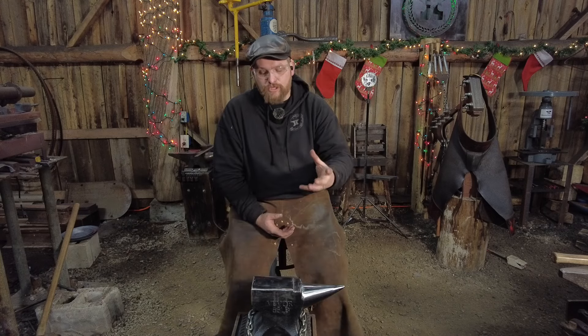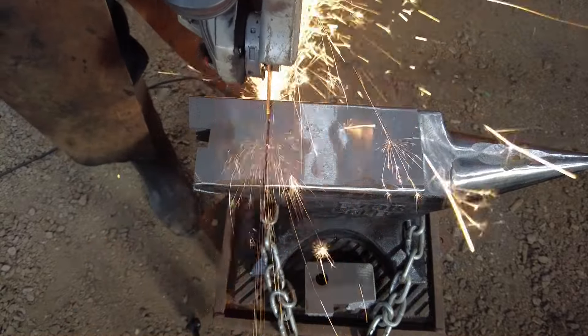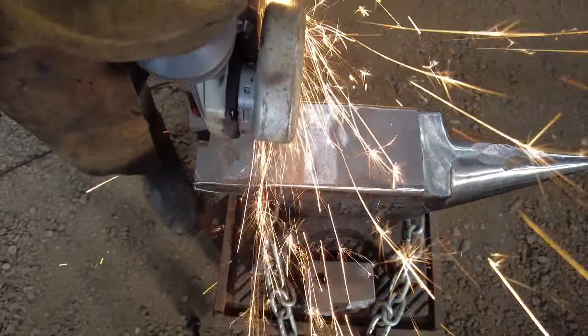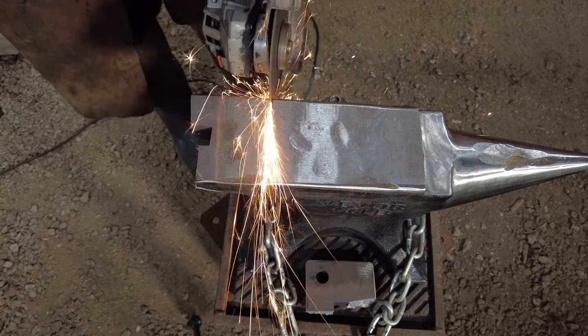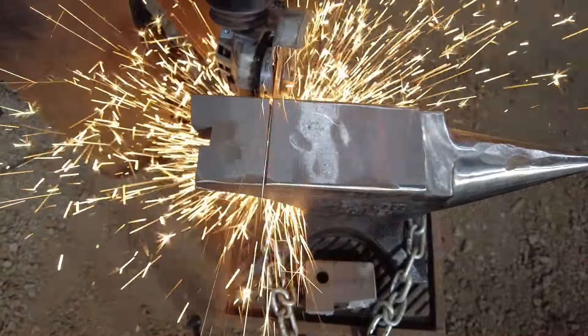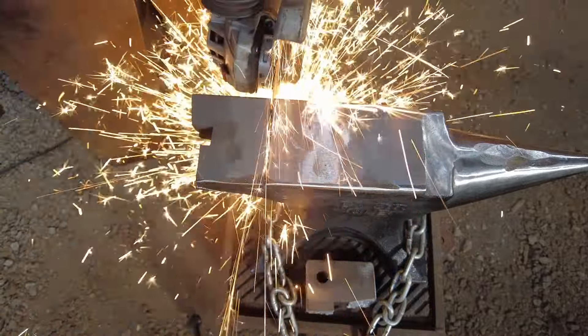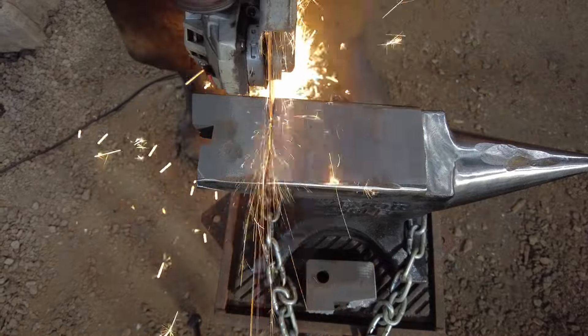After assessing the damage — in this particular case the tail section broke off, and along with that there was a section where the edge had almost chipped out. I wanted to remove all of that to prevent potential future risk of that chip coming out. I ended up bob-tailing this anvil quite short in order to get past any of that damaged area on the tail. If you come across one with a broken tail, you might want to consider bobbing it up — it'll make a cleaner, nicer anvil to work off of.